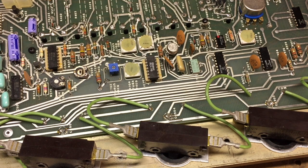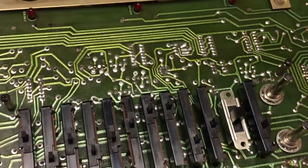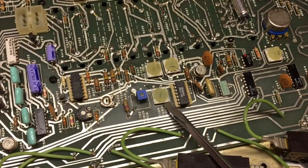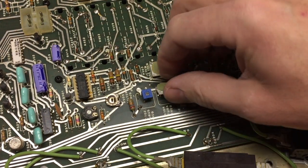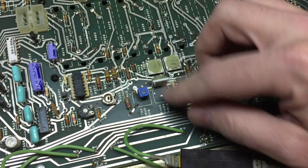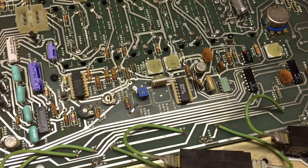I got a couple of these done already and one of the things I've learned along the way is that desoldering the six to ten points of these things in one shot is really difficult. This one's got seven or eight solder points and it's not really worth it. So what I've been doing may shock you, but I've been just prying the whole thing up because we're not going to use it again, and then I use a pair of pliers or sometimes just my hand to get the rest of the way off. You're better off just taking these things off by force and then cleaning out the holes to add the new rheostats, rather than trying to desolder all of them. It just takes too much time.